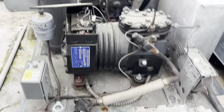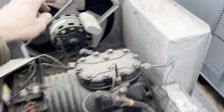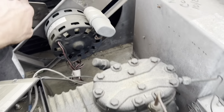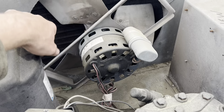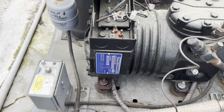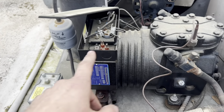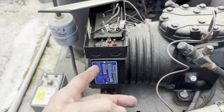This is our remote condenser to a cake freezer — master built. They said it's terminal, been diagnosed as esta muerto. This is dead. The fan motor is definitely shot. This is alarming to me, because assuming the person who was here knew what he was doing, this compressor is definitely no good.